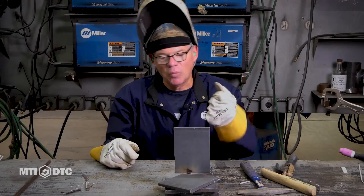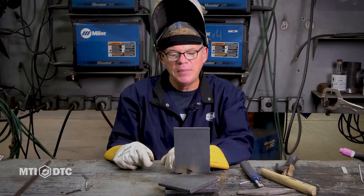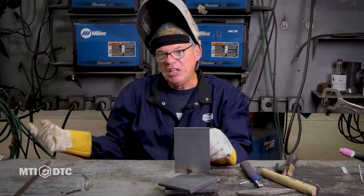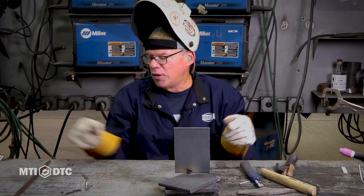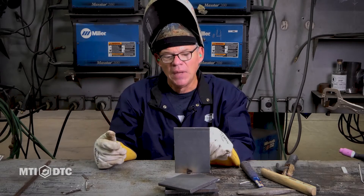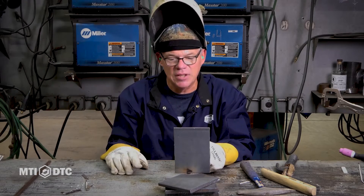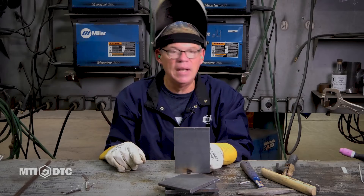Wear your PPE — don't try to be a maverick and weld one-handed. Don't get your face over there when you're chipping. I hope that gives a little insight into stick welding. I know some people are kind of scared of it just because it's a bright light and there are sparks, but it's all controlled. If I were to turn this machine up too hot, it would start putting a lot of spatter out. If it was too cold, the rod would stick and not weld right. Part of being able to strike that rod and get going is setting that heat correctly. There are all kinds of online resources to tell you what amperage a 3/32 7018 should be run at — I'm sure you'd have 25 answers in three seconds. I hope that helps, and we'll see you in the next series. Thank you.